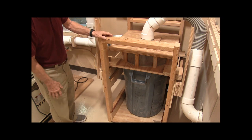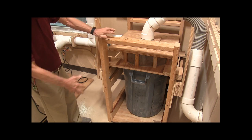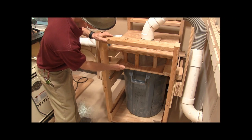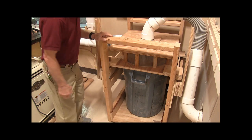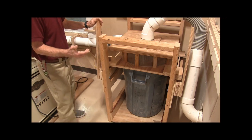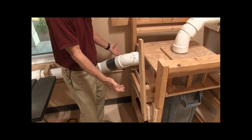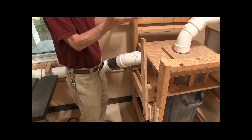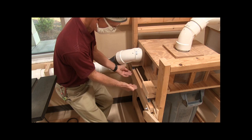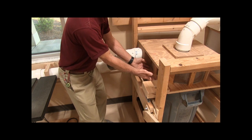I had to adapt the sizes and everything, but it worked out. Now, to make it easy to change this bin and empty the sawdust out, I put the whole thing in a frame so it's mounted and sitting there. That way I could make it so this whole top can lift up and off the drum. If we move the camera, we can see these rollers over on the side. This arrangement makes the lid lift horizontally — it goes straight up. You move this down, and that pulls this bar up and forward. There are little rollers underneath that lift on this pad, which is attached to the top.